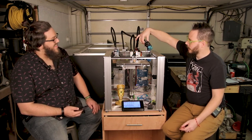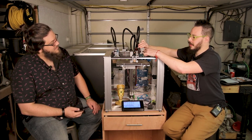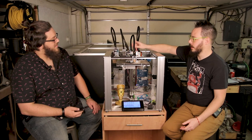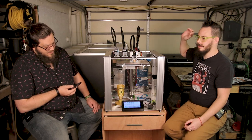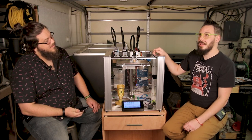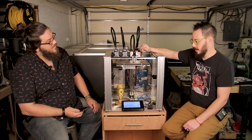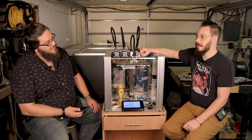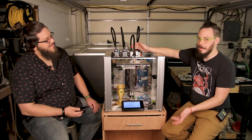Well, that's fair. Okay. The other known issue is I've had these four bolts loosen on me. They are threaded into a printed part. So I put some super glue on it and called it good. And it's worked so far. Other than that, the Hemera heads have been flawless. There is, I guess, another known issue where the weight of the Hemera induces ringing in the motion system. There's a really cool Duet G-code that will give you the ability to cancel that out based on specific frequencies. Interesting. It's in the default Duet config from E3D, and it works.